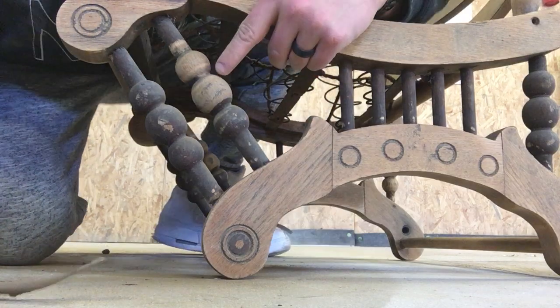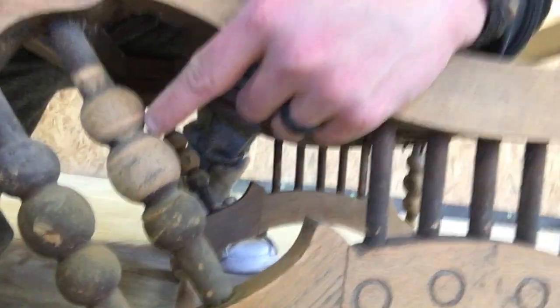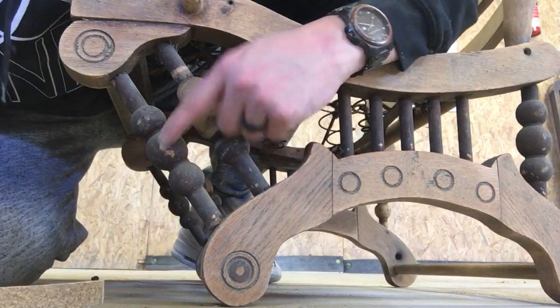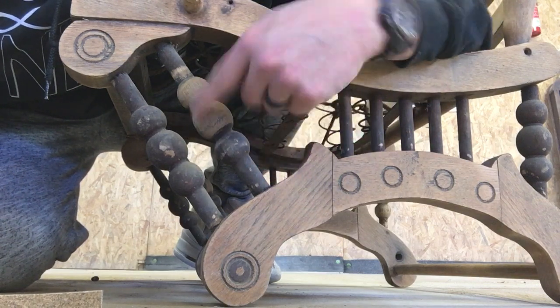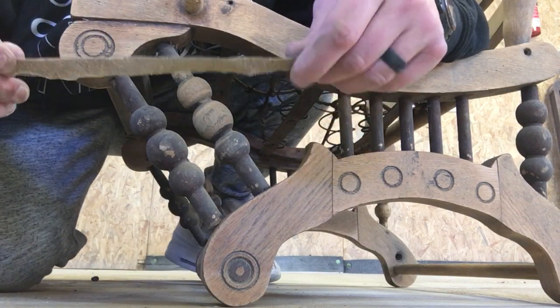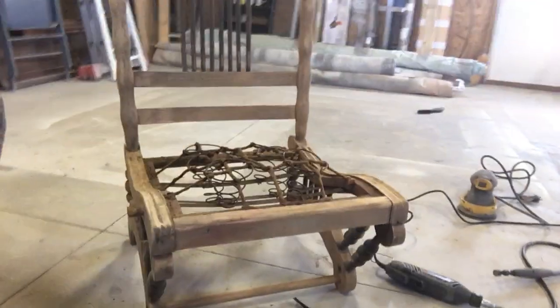As you can see, that little dark spot down in there is really all that's left — just fold a piece of sandpaper in half and work that tight crevice. That's the best way to sand spindles, especially if you've got some crazy-looking spindles like these. You'd hate to jack them up trying to get a Dremel on them and end up with flat areas on a really bulby surface — it just takes away from the chair. So that's it for today — stay tuned for this awesome 1800s glider. It doesn't look like much now, but when I'm done it's going to be brand new again. Thanks guys!